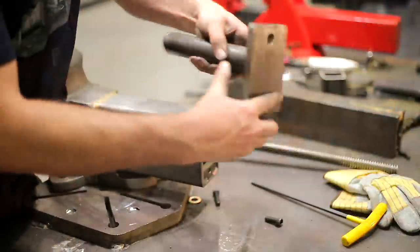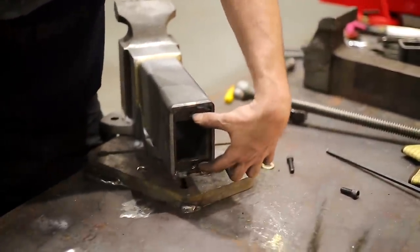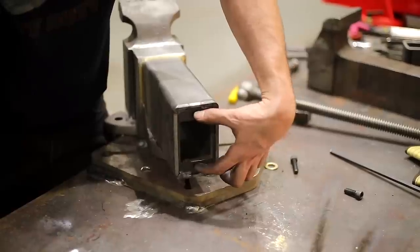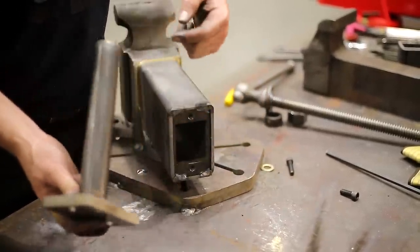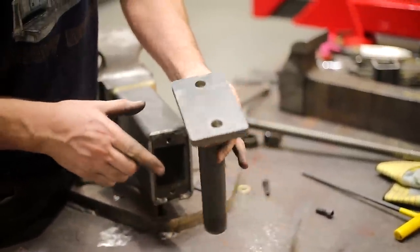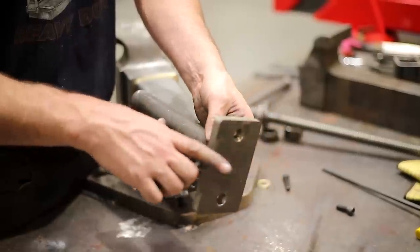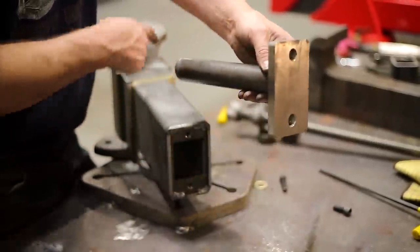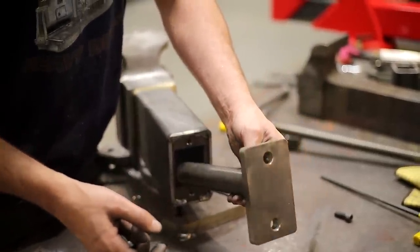Got our nut extension all fabbed up and located and welded on the plate. And as you can see, we have the bracket in the back that this plate bolts to, and then clearance in here for the tube to slide through. Since this is removable, unlike the red fireball vise, I can experiment with different thread pitches and just make this piece and a new screw and keep the body and everything and do some experimenting with it.